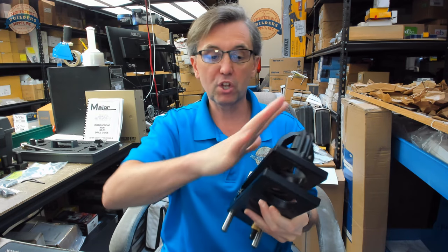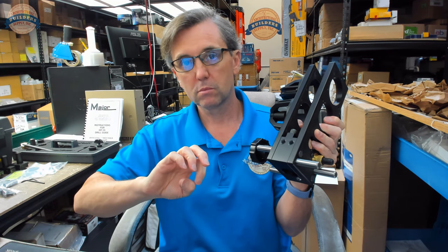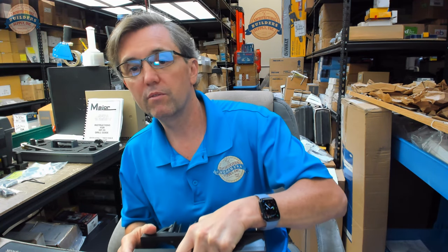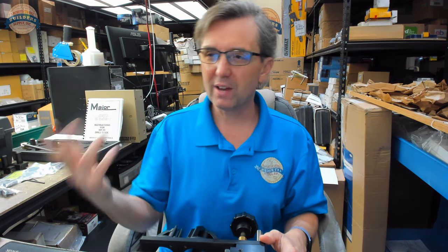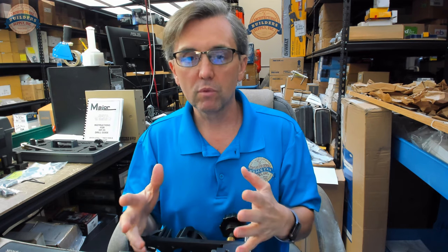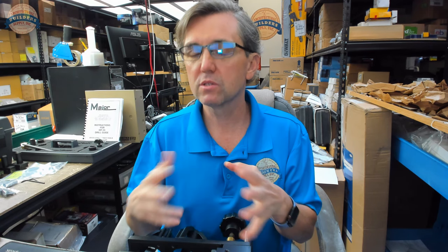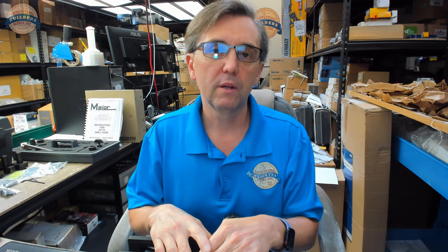When you're done with the tool, you must thoroughly clean it. That mineral core will destroy threaded components, every single time, in fact. So the tool must be very well cleaned, is my tip. That mortise pocket maker, the 516, the Porter Cable, I have literally ruined those tools because I haven't kept them clean enough, is the bottom line. And in fact, and it's really just the bronze bushings, I find that the older versions of those tools are more tolerant to that sort of work when it comes to mineral cores.